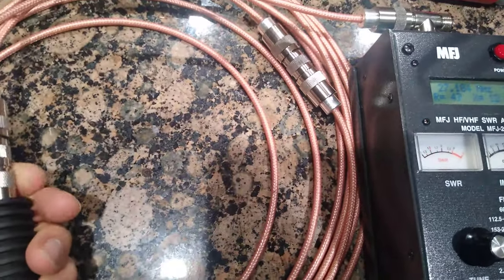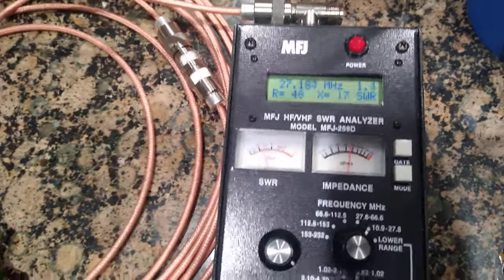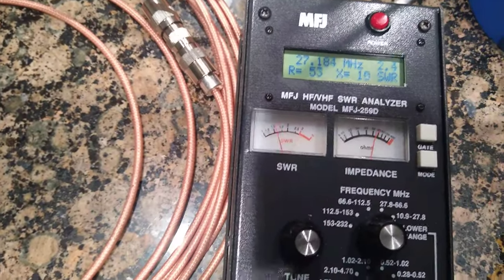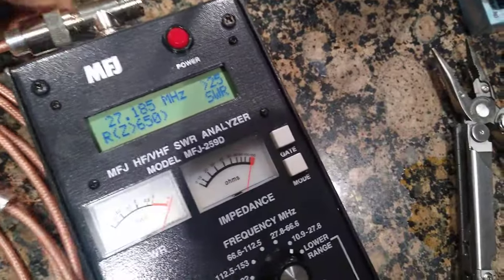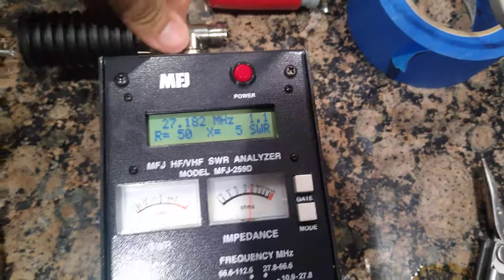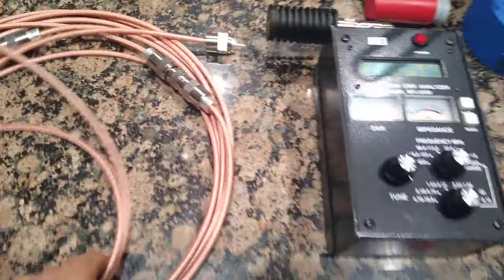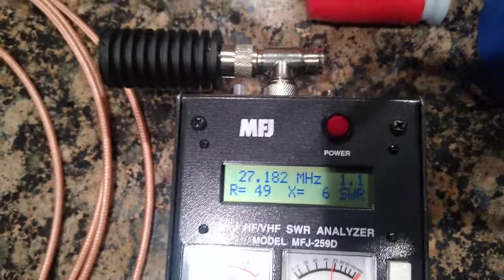Personally, what I can see is that I think the best way to do it is a half wave, because the radio does not see a half wavelength at all. Maybe the quarters do work, but the half seems to be the best way to go - if you can spare the dB loss in a couple of 12 foot jumpers. I think when you're tuning these things, preferably you want a 12 foot half wave. That's my thoughts - what do you guys think?